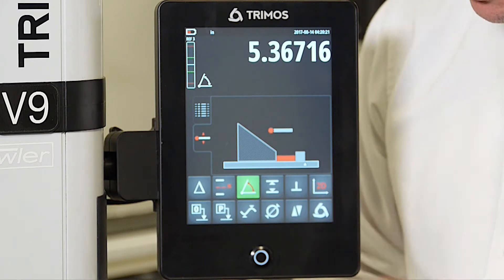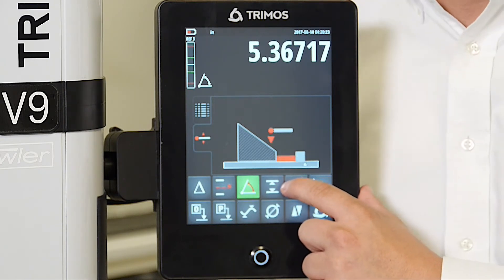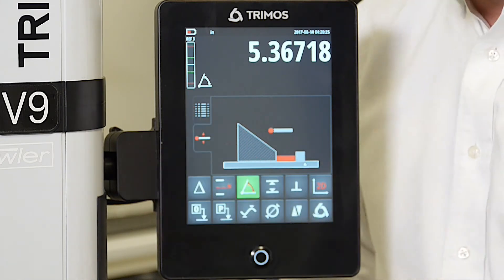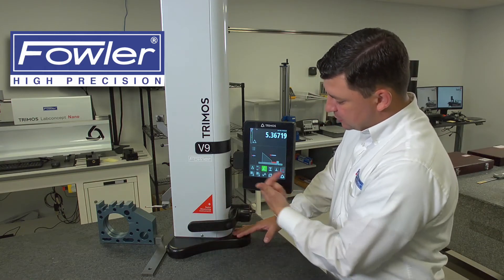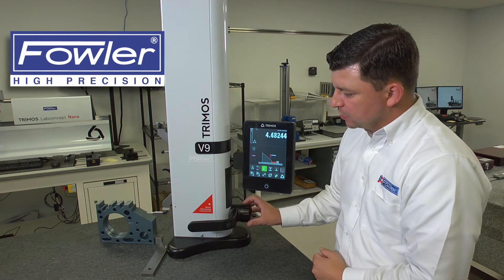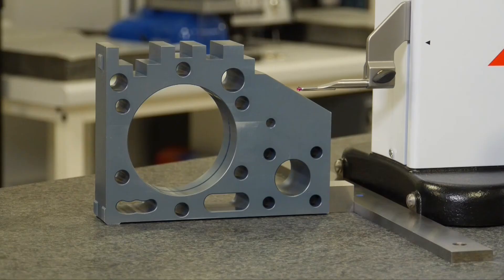The gray box being our straight edge, the red block being our gauge block, and the angled piece being whatever part it is that you are measuring. Now that I'm set in position as the gauge has told me, I will walk into the surface and take my first measurement, engaging the probe and releasing it.